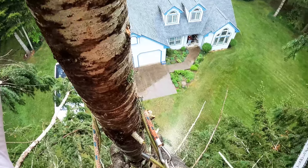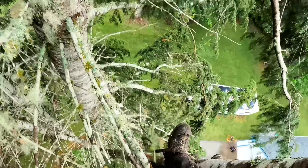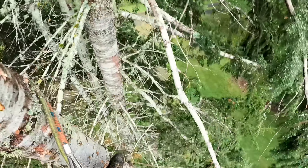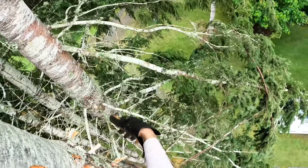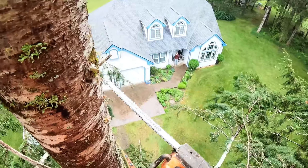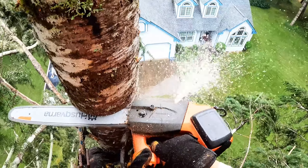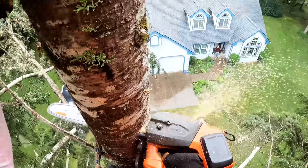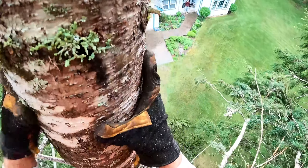The piece is moving around, I can see it — I can just break it off. You're trying to get these pieces to land as flat as possible. So before you snap them off, kind of visualize how long the piece is and how it's going to rotate to the ground. If you can get them to land flat, they cause a lot less damage to the ground and to the log if you're trying to save it for something. Watch for the piece to move — take your saw out, you can drop it if you need to. Try and make it land flat.